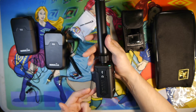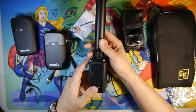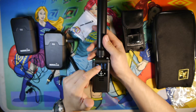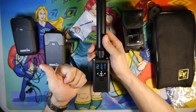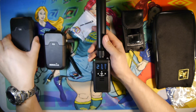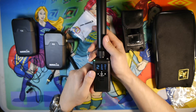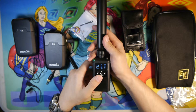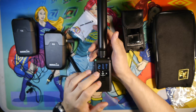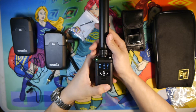Three, it's got different battery options — you can power it with AA batteries, USB, or Sony NPF-style batteries. Four, the display gives you more information, and especially on the XLR connection port, you don't just get 0, 10, and 20 decibels of gain like you normally get on the transmitter side of the Filmmaker Kit. On the XLR side, you get up to 40 decibels of preamp gain with this unit. If you switch to the 3.5mm input, you've only got the same amount of decibel gain as the Filmmaker Kit, so it's important to note that.